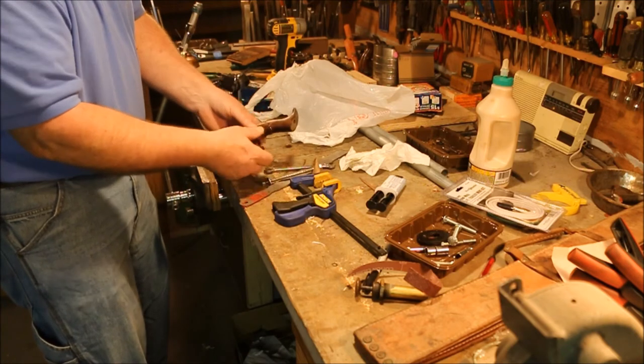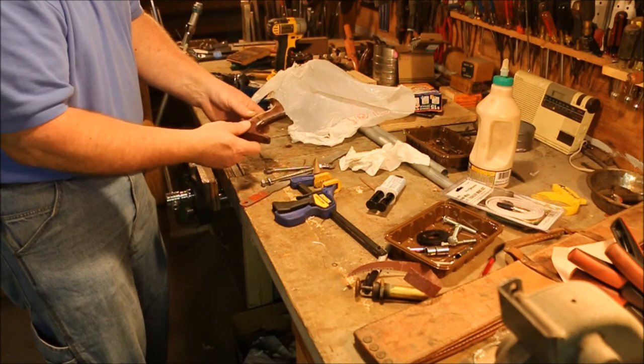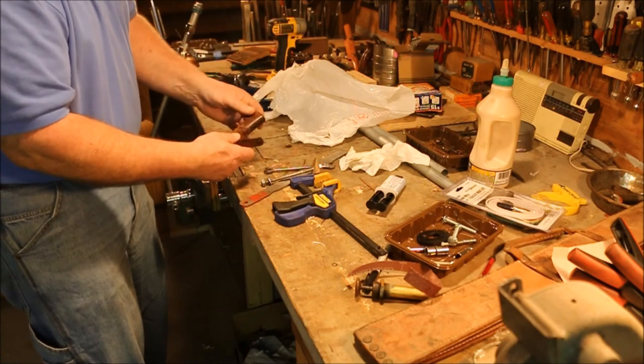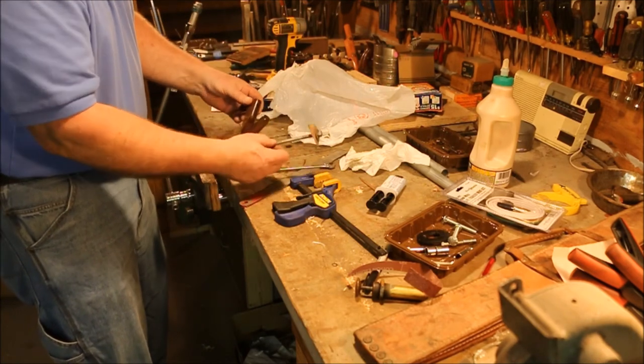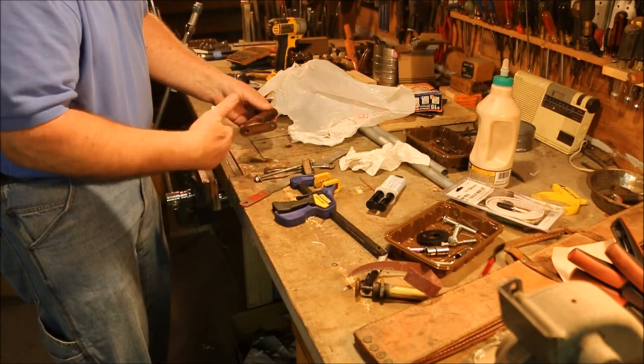Also, when they're broken, they don't always line up back perfect. Sometimes the front's a little tight or the back's a little tight and it'll cause it to kick, and that'll tend to lock it up on the screw. Just crank it out. Having a full thread on there means that you can just take it out like it's a bolt.